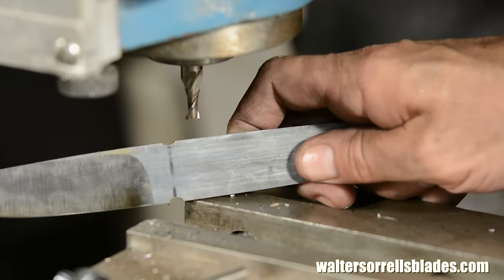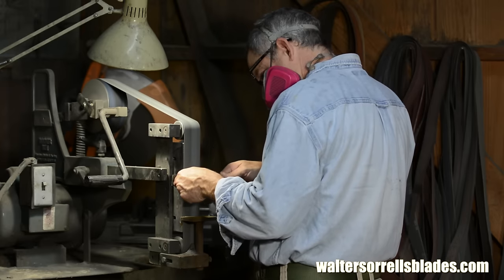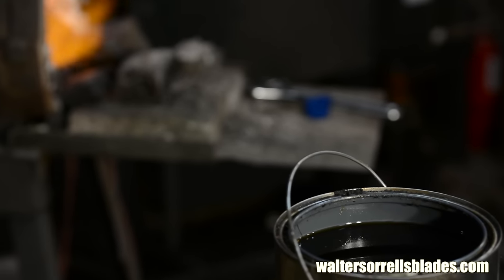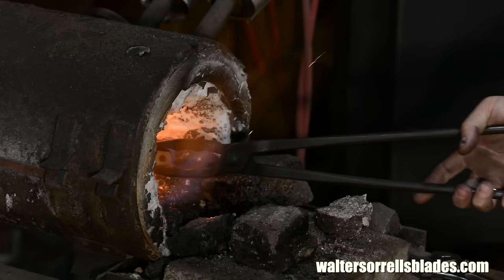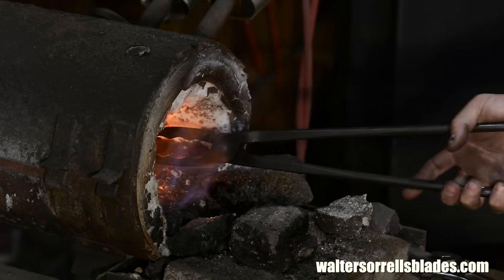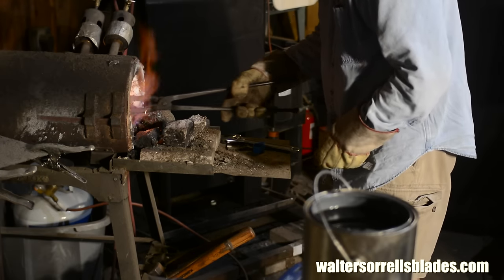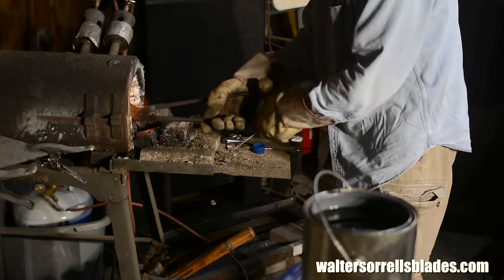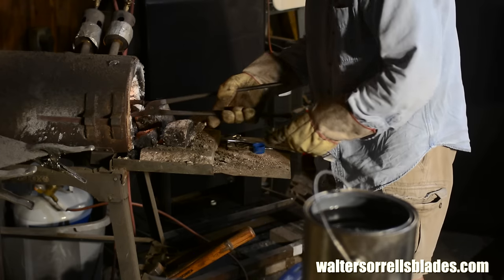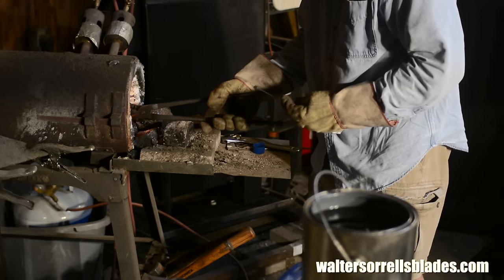Now you've got a knife-shaped object — it's still not quite a knife. The step that makes that final transformation is what's known as heat treating. Soft metal becomes hardened steel in an instant. I've been showing multiple methods, but in this case I'm only showing one — because setting up a charcoal fire in my backyard was a pain. But if you buy traditional hardwood charcoal, attach a piece of black iron pipe to your wife's blow dryer, and blow air into a charcoal fire, you can produce temperatures in excess of 2,000 degrees Fahrenheit — enough to burn a hole straight through your charcoal grill, and far more heat than you need for this project. Just pile it up and blow some air into it.